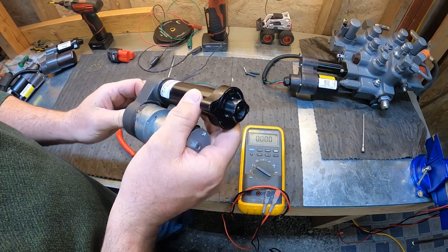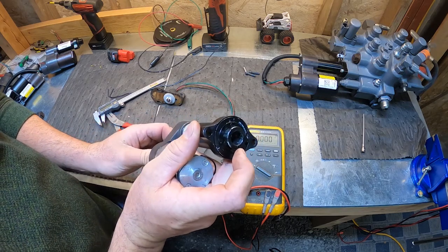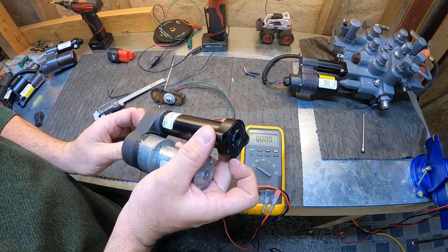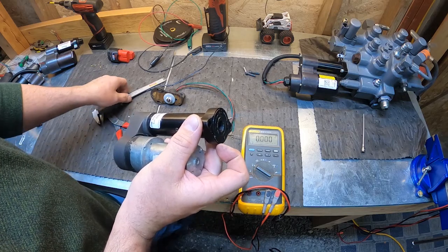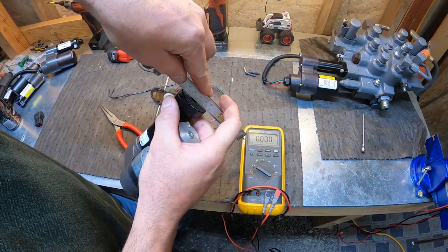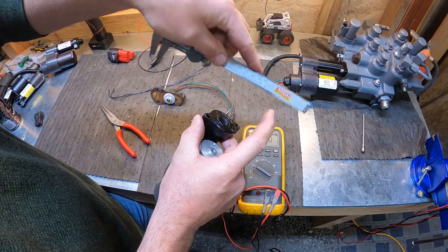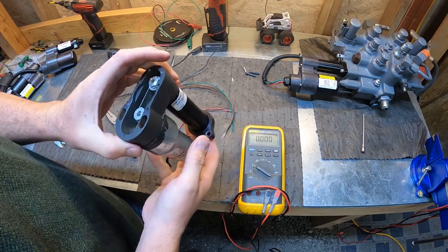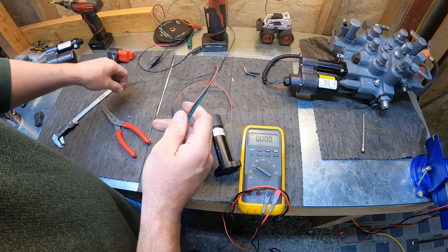We're going to bring the actuator in. The actuator piston is going to be flush with the actuator body. So we've got to spin that in. It's right there. I just use my straight edge there to verify. It's perfectly flat there. So that's the center position of the actuator. Now we have to tell the computer that's the center position.